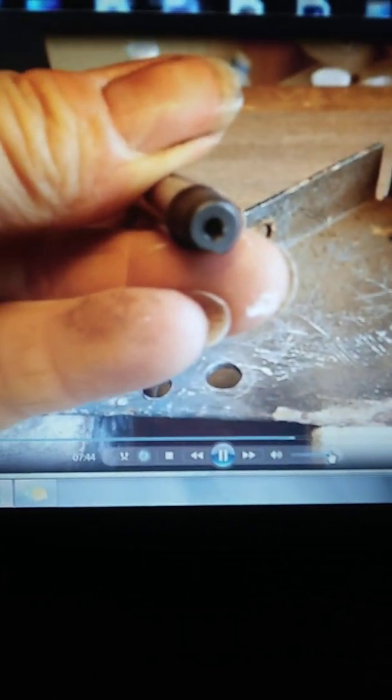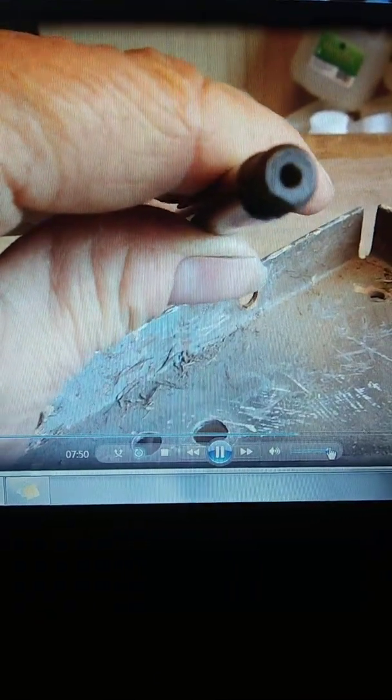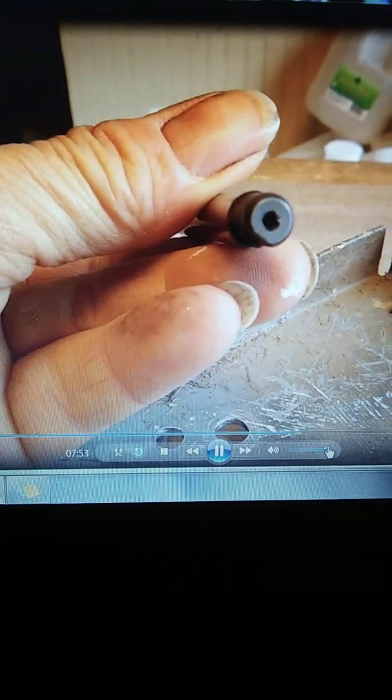This end goes in okay because it's machined smaller. Notice also that on the end of each mandrel there's a hole — that's good because you can take the sharp point of your tailstock and put it in the hole of the mandrel, and that'll help to stabilize your work when you're working on it.